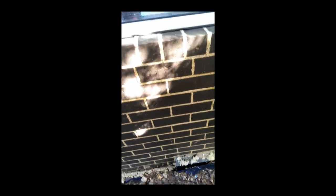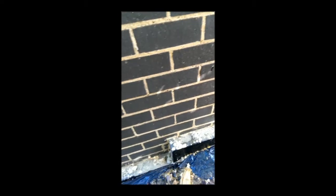I've only washed up to here, so you can still see - still hard. It is getting better, cleaning up, but it's still not satisfactory. That's the brick I was working on before - it's cleaning up but there's still shadows there, and what's left behind is still hard. I've given this section a second go of hydrochloric acid - just a quick wash with the pressure right back off just to get rid of the shadows. That's after 2 washes of hydrochloric. This is 3 washes of Barracuda and I've still got bits left behind.